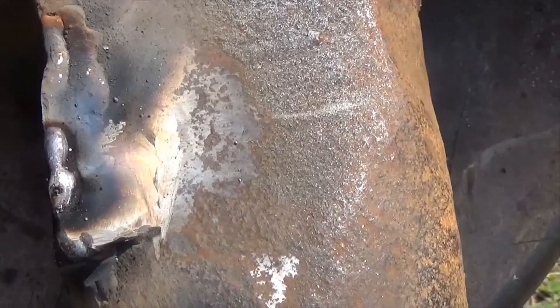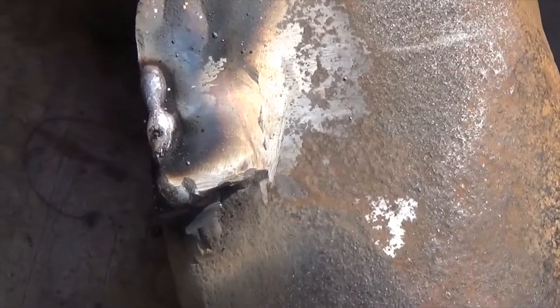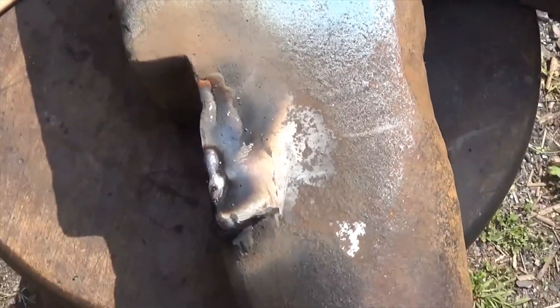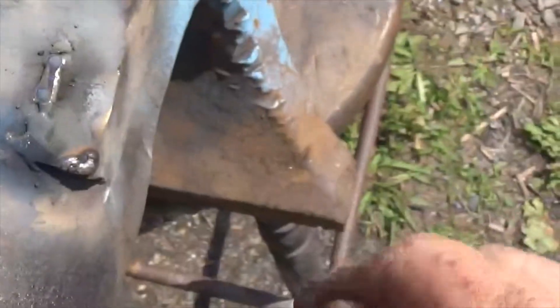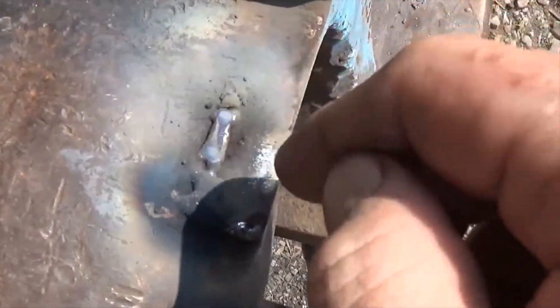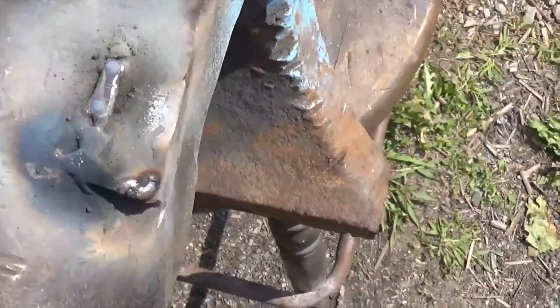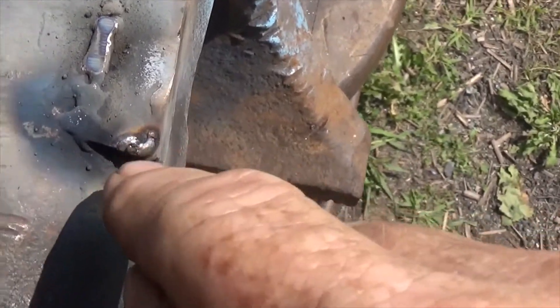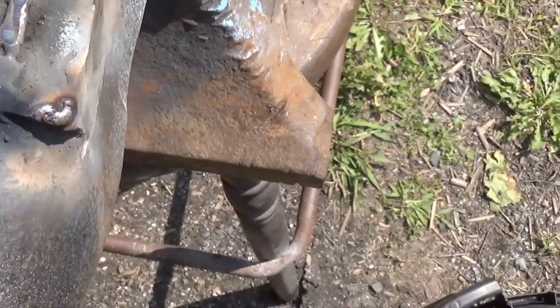There's a bead of the hard facing on there — it really looks like any other weld. I'm putting the final shape on top. I've done a weld here with the hard facing, so now I'll have a nice edge for pounding both ways. If you just use the farmer's rod you're going to get dings in it — I made that mistake on another part of the anvil. So I'll keep chasing some cracks and fillings, build this section up with 6013 first, then finish it up.